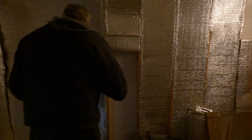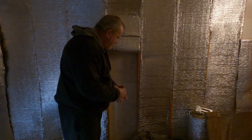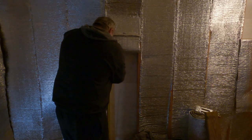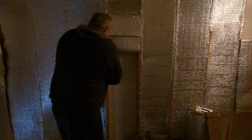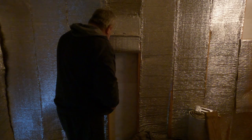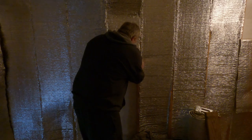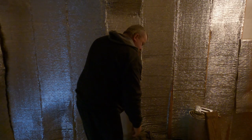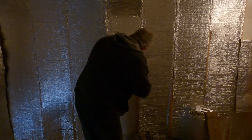All right, so the washer and dryer together will come out to right here. Now I want to mount my outlet a little higher than the washer, which is 44 inches. And I got to keep in mind I'm going to probably do a 6-inch pedestal. So about right in here, I'll probably want the top of the outlet. Leave it out a little bit for the wall board, which isn't very thick. So I'm thinking right there will be the first outlet. All right, right at the top of that staple. Let me go get a hammer.